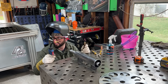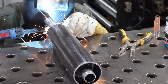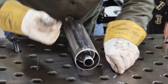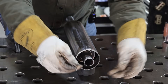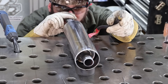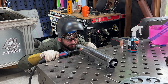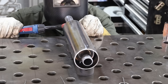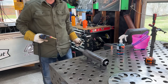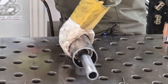I've got a gas hose here — I took it out of the back of the machine and I'm going to point it right where I need to weld. I took the nozzle off. That's not ideal — a little bit of porosity in there. So I pulled out all four pieces of the fit-up wire from the bottom and put a gas diffuser on the end of the hose. Hopefully that gives less porosity. Still got some porosity — not ideal, guys, but it's also not that big of a deal for what I needed to do. I just needed to stop those things from rolling; they only need to be tacks anyway.